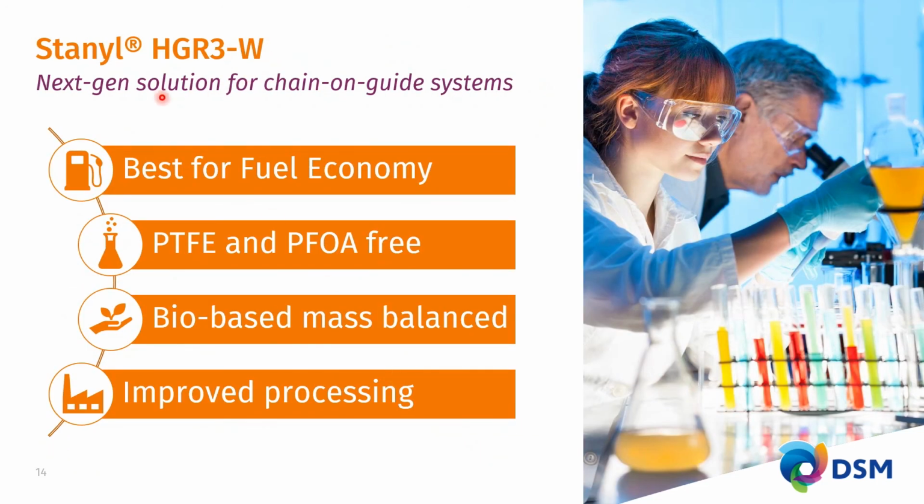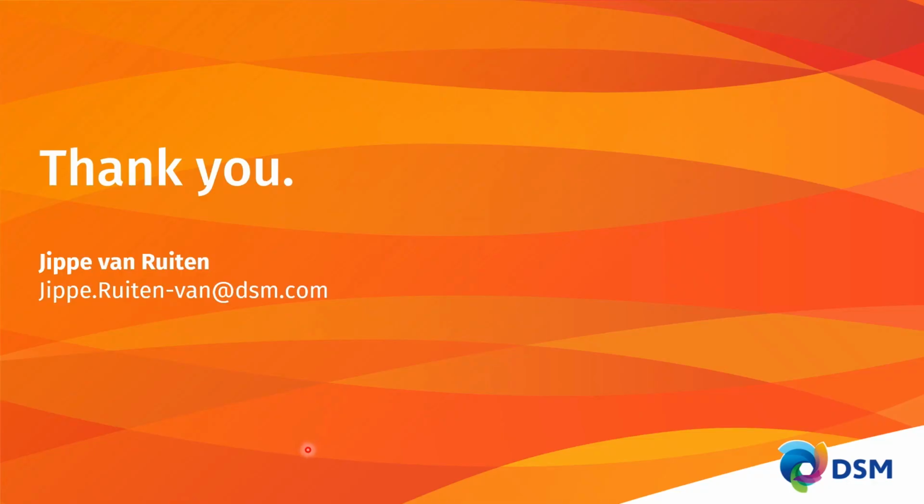In summary, Stanyl HER3-W, the next generation solution for chain guide systems with a focus on best fuel economy, lowest CO2 emission, lowest penalty. We're bringing to market a PTFE and therefore PFOA-free grade. HER3, we've found better additives than PTFE to reduce friction. It is built on a bio-based mass-balanced PA46 base resin, and I've not touched upon this in great detail, or in any detail for that matter, but the HER3-W is improved in processing when compared to the PTFE containing alternatives in the market. With that, I would like to thank you for your attention.